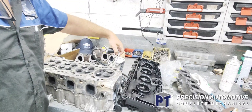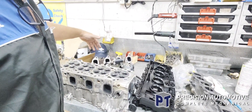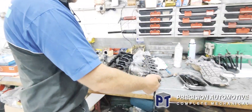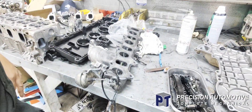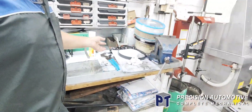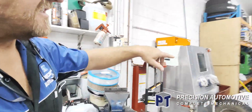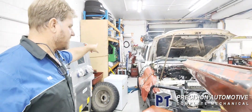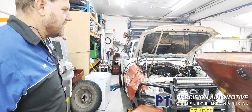So I'm pressure testing the EGR valve as well just to make sure. It's had the manifold machined, swirl flaps and all that sorted out — had all those cleaned up. We're going to finish cleaning all those off. We're going to test the injectors now — we've actually got our own test bench, our own diesel injection bench. We can test like 4,600 different types of injectors.